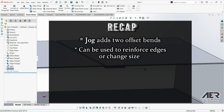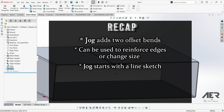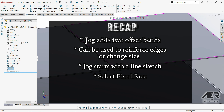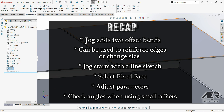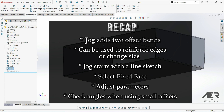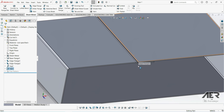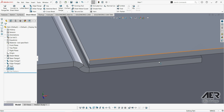To make the jog feature, first we need a single line in a sketch, then we use the jog feature and select a fixed face — the face that won't move. Then we can adjust the parameters: things like jog offset direction, position, and angle. Remember, if we have a very small offset with the jog, we may need to play around with the angle to get the correct offset. In the next video we are going to look at sketch bends, which are kind of similar to jogs but just use a single bend, so they're actually a bit simpler.